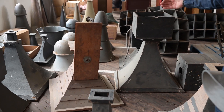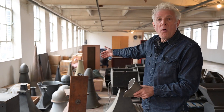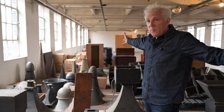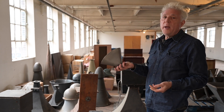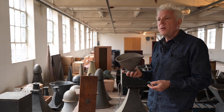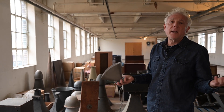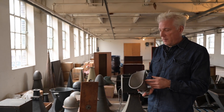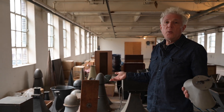Sometimes the space between the screen and the back wall isn't very much, so they couldn't have a huge horn — they made them as short as possible. For us at OMA, we don't have those constraints. We just designed the horns based upon what we think is going to be the best possible sound quality given the package we're trying to achieve. I hope that explains something about how horns operate and why we do what we do. Maybe a little talk about efficiency would be a good idea next.